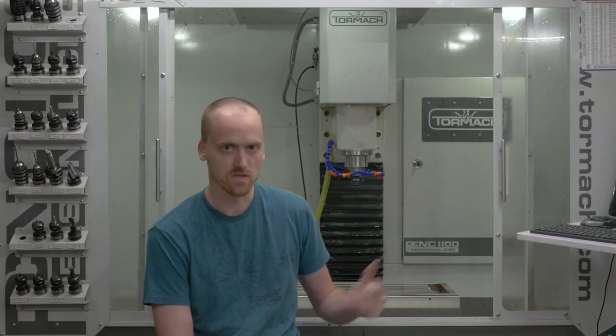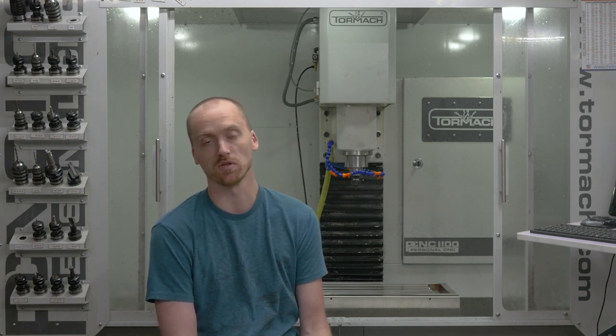Along with the flood coolant, the other thing I ran into was that this thing leaks like crazy — maybe not so much with the factory drip coolant, but I went through three iterations of trying to waterproof it before I just broke down and epoxied the entire thing together. I tried silicone, I tried Flex Seal, I tried the rubber caulk tape they ship with it. Every time I'd let the machine run for a while, I'd come back to puddles of coolant on the floor. All the cabinets underneath the enclosure were full of coolant, and the computer was sitting in coolant multiple times. It's sealed up now, except when the chip strainer gets full and coolant leaks out.